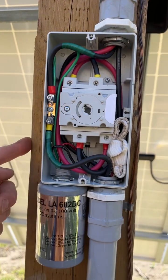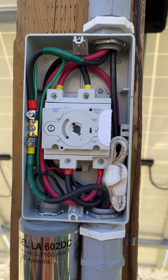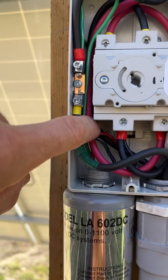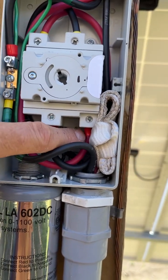This is a six-inch box — it's about three and seven-eighths inches. A two-by-four is three and a half inches, so it's already wider than a two-by-four. Just give us another quarter inch on each side — half inch wider — and we'd just have a bit more room to fit our stuff through. It's tight.